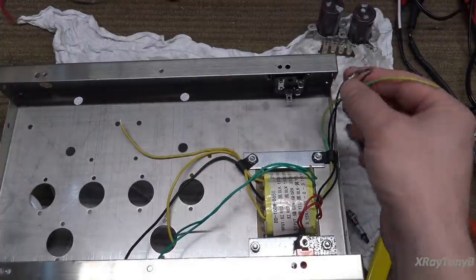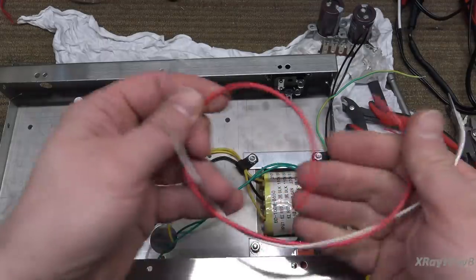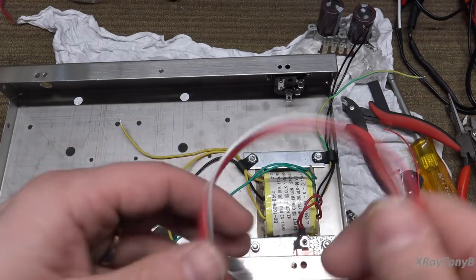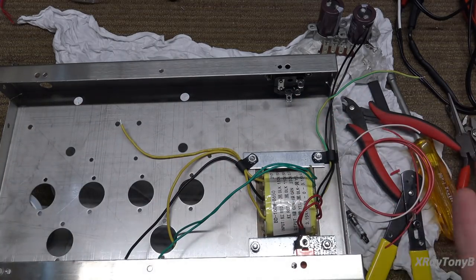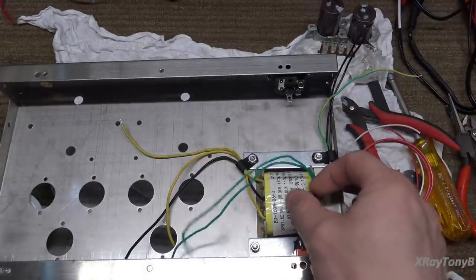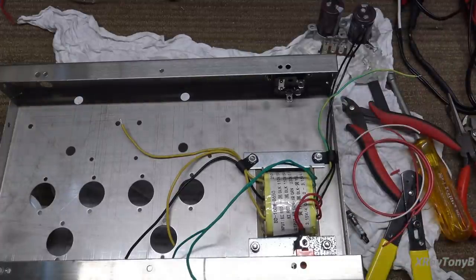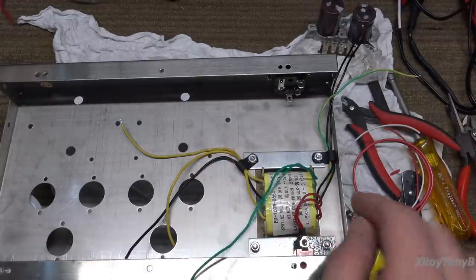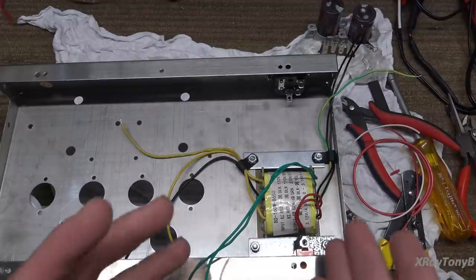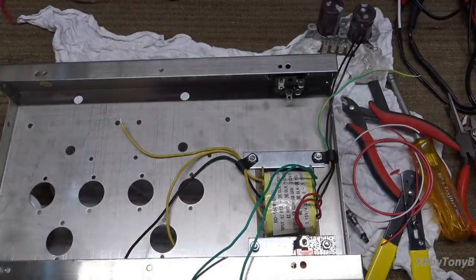The coax that comes with it is used for the input section — it's a shielded wire, and we'll get into that way later in the video. For the mains especially I like to use a little bit heavier stranded wire. For the indicator light I'll use something similar to the thin stuff. Some of you have mentioned that this transformer doesn't follow normal color codes — that's absolutely true. A lot of modern transformers from cheap kits don't follow any standard color code, so you'll have to go by the sticker on the transformer or by looking at the actual windings.